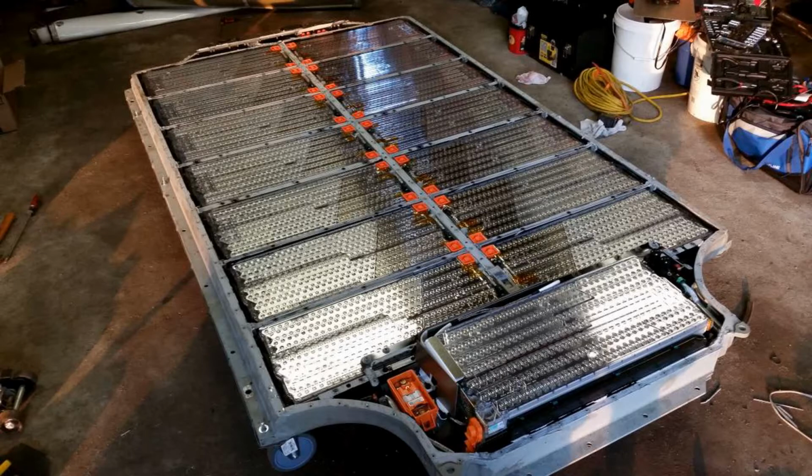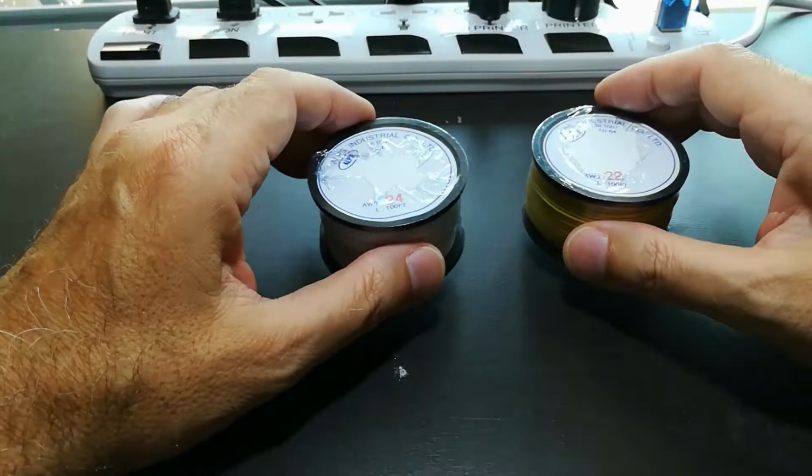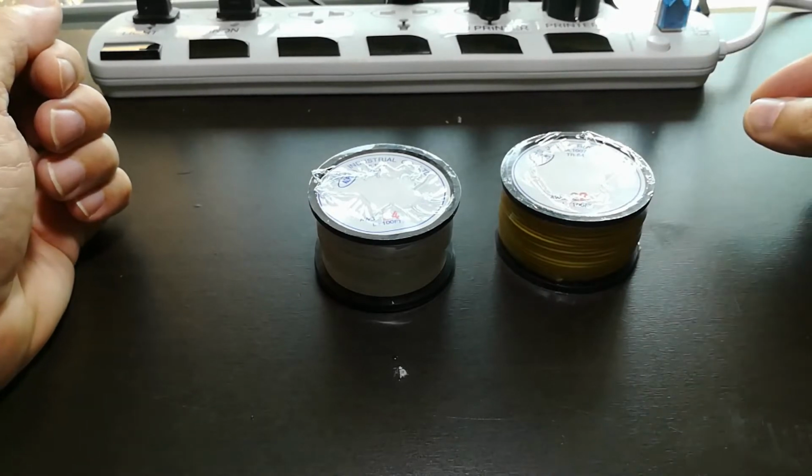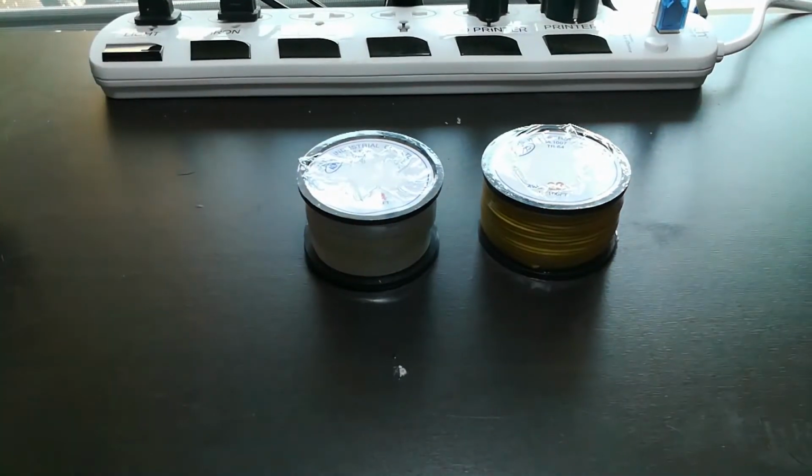Now, this is actually how Tesla wires up the battery packs in their car. Every single 18650 cell in a Tesla is wired with small gauge wire. When a cell has a problem and starts either sucking in or pushing out too much power, the little fuse blows and takes the battery out of the circuit. You've taken away any risk of fire or overheating or cascading damage to the rest of the pack. And I have seen YouTube videos of people using this scenario for their packs also, in addition to that nickel strip type. So this is my plan, and we'll see how this works out.